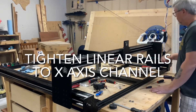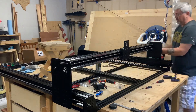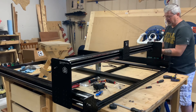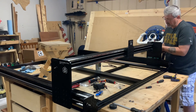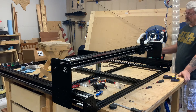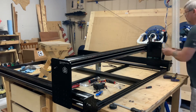Now it's time to tighten the bolts on the linear rail in the 4080 c-beam. I found it easier to use a drill — I lightly chucked the drill onto the motor end of the acme screw and slowly moved the gantry as needed. We follow the same process as in a previous video for the y-axis: start at one end, tighten the bolt on the top and bottom rail, then slide the gantry and tighten the bolts as you go.